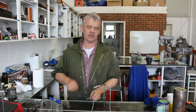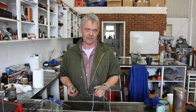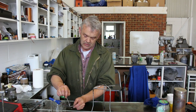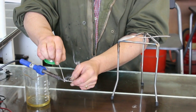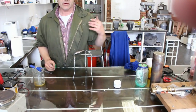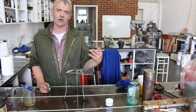Now we've put our copper plate onto the stainless steel, we're going to solder onto the copper plate. The easiest way to do this is to tin both surfaces and then solder them once you've tinned them. Tinning the wire is dead easy — wait for it to heat up and wait for it to draw the solder in. And there you go, there's your wire all tinned up and ready. The reason it's so easy is because it's a small thermal mass; you're not having to heat an awful lot of things.